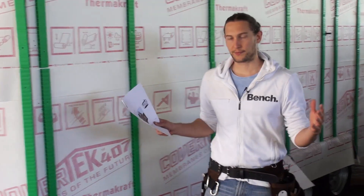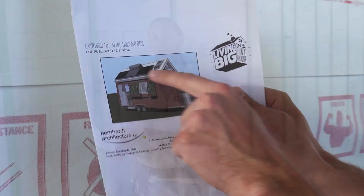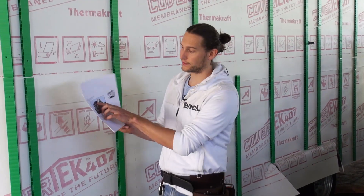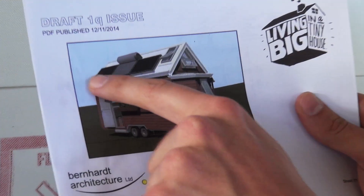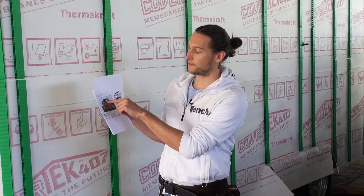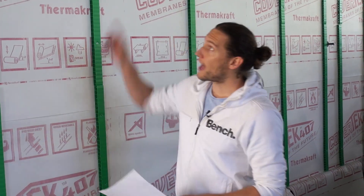Even though our tiny house is designed to be a mobile structure, we have actually designed it with a north-facing aspect. The northern side of our house, as you can see on this plan here, is virtually entirely covered in solar panels. Those solar panels essentially create almost like a second roof by shading the first roof, which creates even more of a cooling effect. Having the white roof and that lower temperature will also aid the solar panels, increasing their efficiency by having a cool backing for the panel and creating that diversity between the front, which gets really hot, and the back, which wants to be cooler.